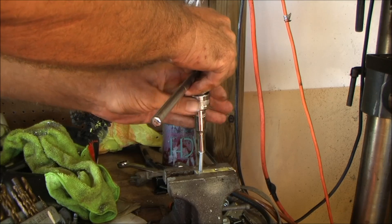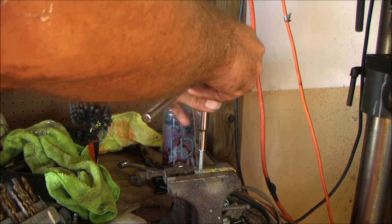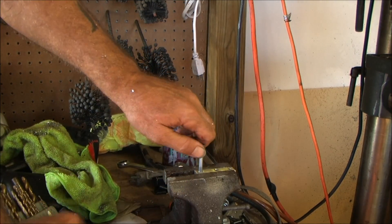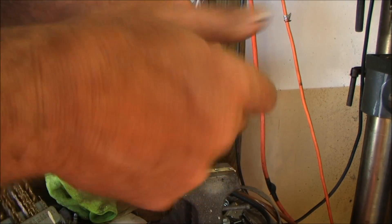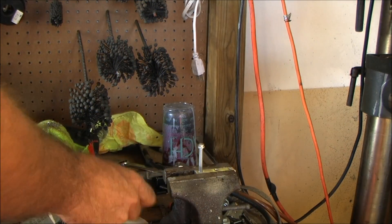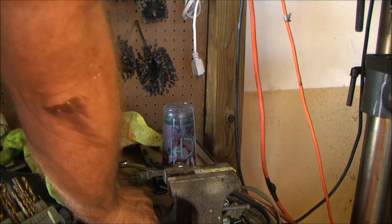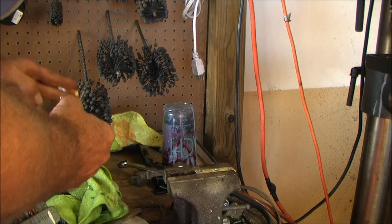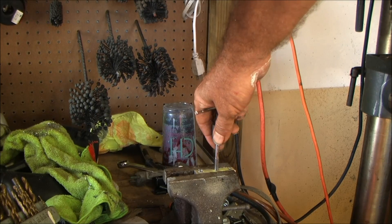In case you're wondering what I'm making — this is for a '97 VT 1100. The coil brackets are angled out instead of straight down, and I need them straight because it's pushing the coil towers into the frame. I don't like that. I'm putting Accel super coils in there. I do nothing that doesn't get a decent set of coils — well, okay, every now and then I do, but I try not to.